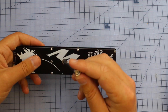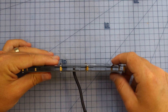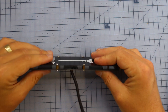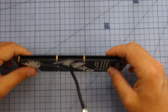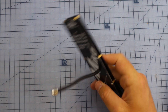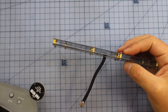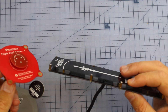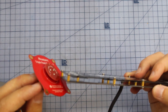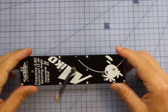So it's a fairly narrow beam — 90 degrees horizontal, 45 degrees vertical — meaning if it's facing out the front of your goggles you've got a 90-degree arc to fly within while still getting good reception. It might be suited for long-range missions. The design itself is available in SMA or RP-SMA. The actual receptive part is a really thin little plate in the middle, sandwiched between two outer layers to stop that internal part getting damaged. Let's take it out to the field and compare DVR against the triple feed patch.